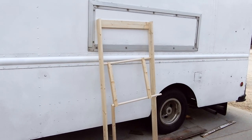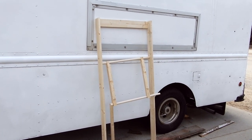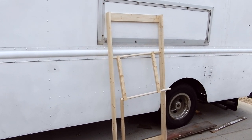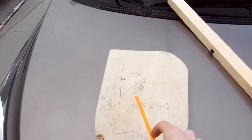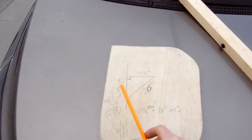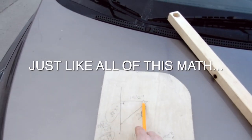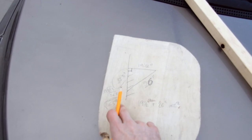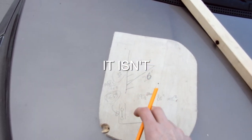So I've been doing some more thinking, and I've come to the conclusion that the tabletop needs to be made last. So I'm going to make the whole mechanism, and then I'll attach the tabletop. So I've taken off one of the struts here because I've just been doing some mathematics, and whoever said you don't need trigonometry in school is wrong. And it looks like 6.5 inches apart is the perfect spacing for those hooks, if you will.